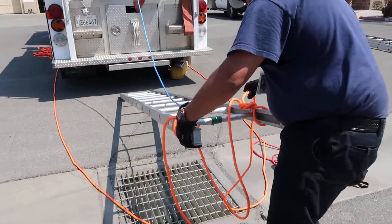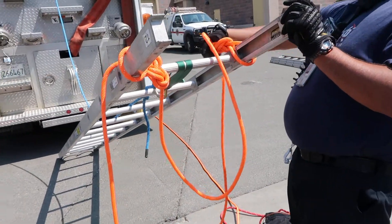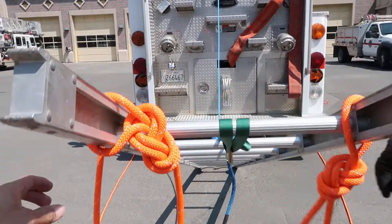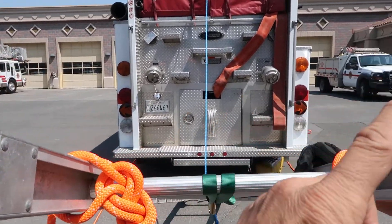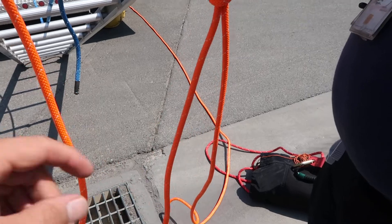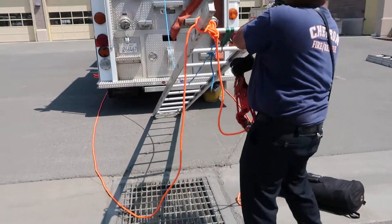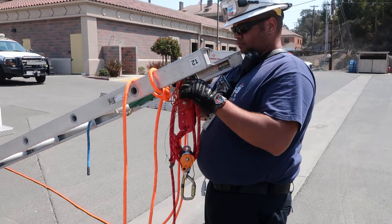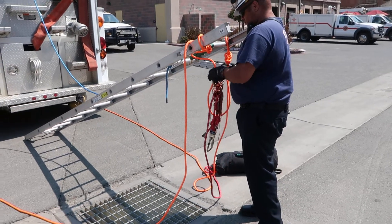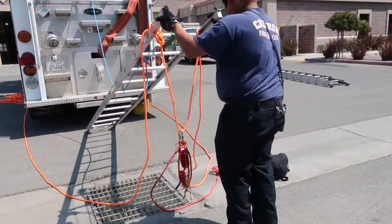As you can see, he's going to connect that — stand off to the side once he gets it connected. Flip that knot on the other side a little bit. He's capturing both sides of the ladder by doing a figure eight, so each guy line goes to each side, and in the middle — it's a little long, but this is where you'd connect your system. Go ahead and clip in that four-to-one. The key is to clip in the system before we start raising the ladder, because once it's raised, it's a pain to clip in.